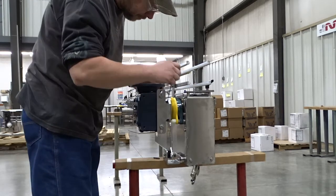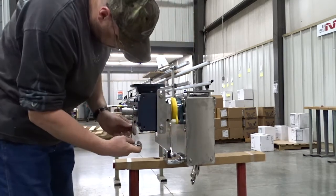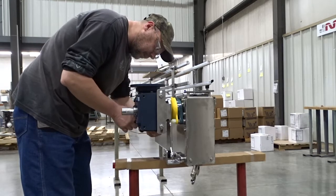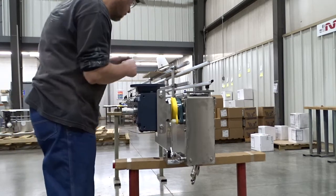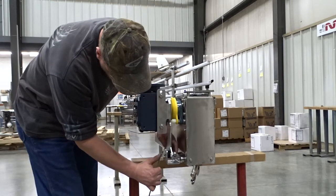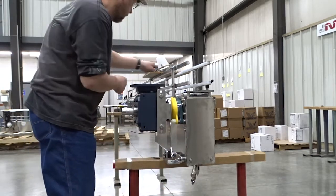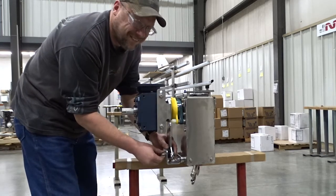There's 4 set screws on the shaft that need to be loosened with a long Allen wrench. Once those are loose, we can remove the 1/4-20 shoulder bolt that's holding the torque arm in place. Again, there are some small parts with this, washers and such, so keep track of those parts.